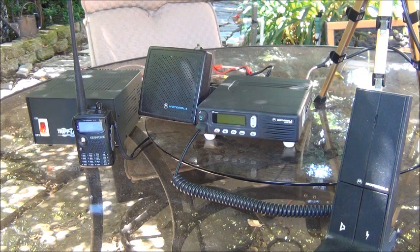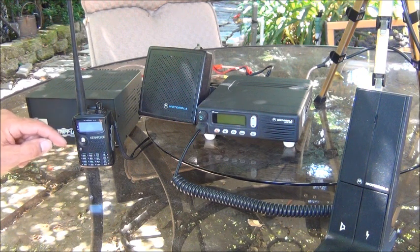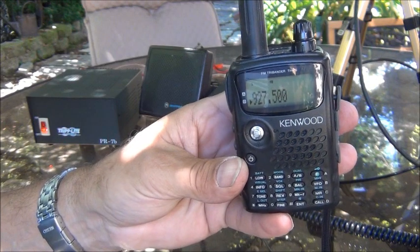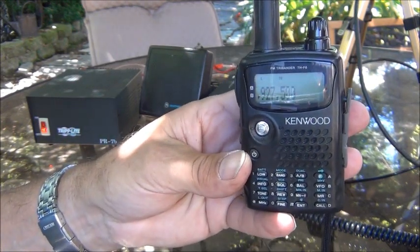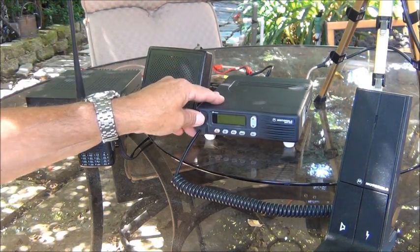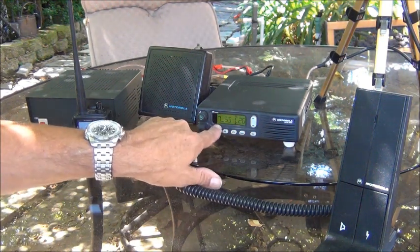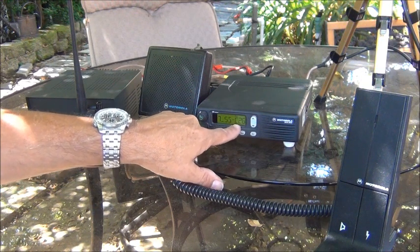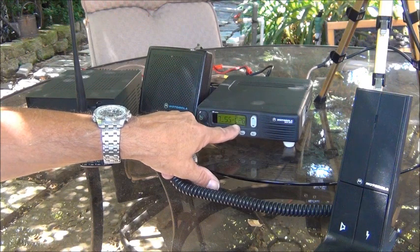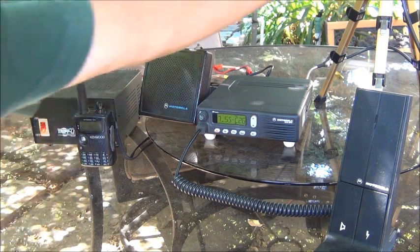Here's my example setup. I've got a Kenwood TH-F6 handheld that I'll use for receive on the B-band. Here's a close-up of the radio so you can see what frequency it's set to: 927.5. And I've got a Motorola MCS-2000 radio — let's turn this on, I've already got the power supply on. The way I've coded this front panel, it's 7-5S-C26, which means it's 927.5 simplex, carrier operated, channel 26. I'm hooked up to the little antenna.